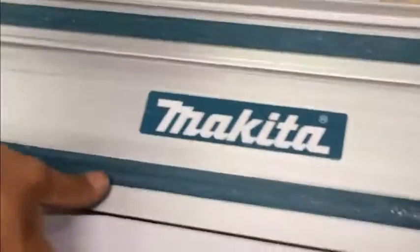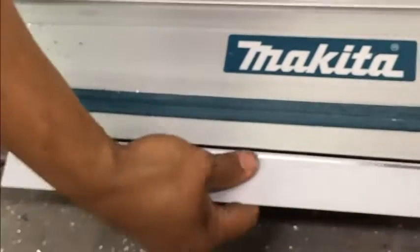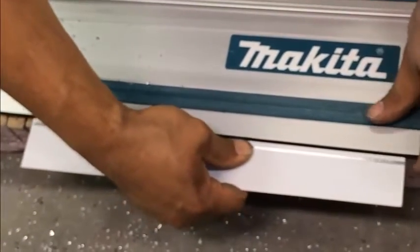If you get a real close-up of this groove here, it's like a 45-degree or 90-degree total groove in there so you can bend it really easily. You have to practice on some scrap sheets — if you don't cut it deep enough it's not easy to bend, and if you cut it too deep it will cut right through the sheet. So practice on some scraps first.